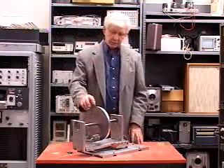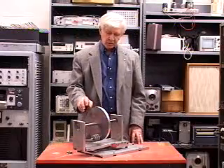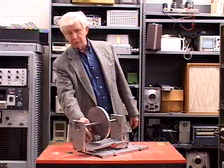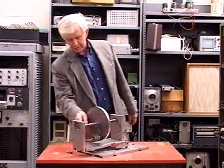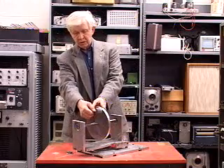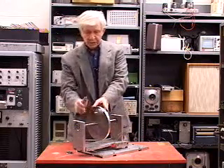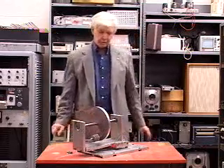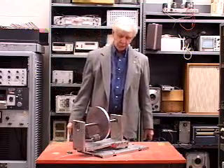The natural frequency depends upon the angle, the moment of inertia, and the restoring mass. In this particular case we can bolt on various amounts of mass here, and by weighing those we can actually get all of the coefficients of the differential equation and do it right.